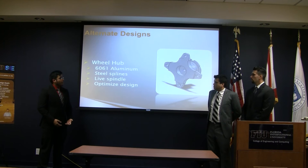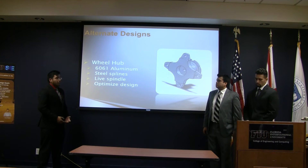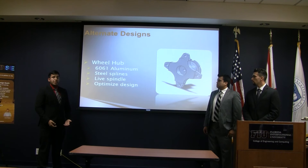For the wheel hub, our current design is very robust and heavy. We plan on using a more slimmed-down, optimized design using 6061 aluminum in order to keep the weight down while maintaining the same strength. A lot of people suggest using 7075, however the cost-to-benefit ratio we have done points more towards 6061 aluminum rather than 7075.